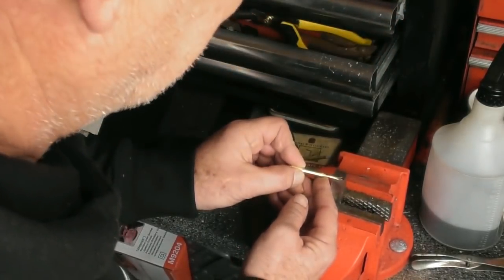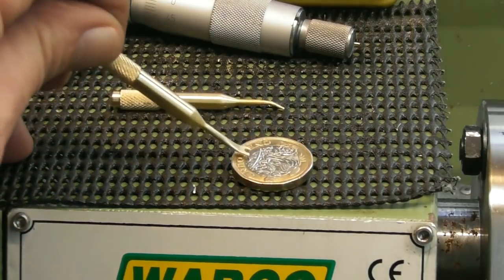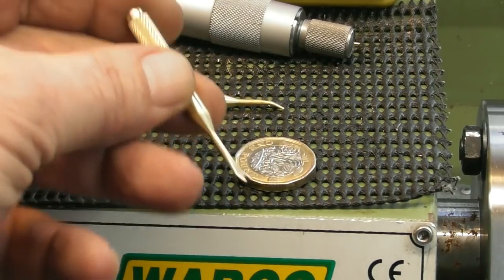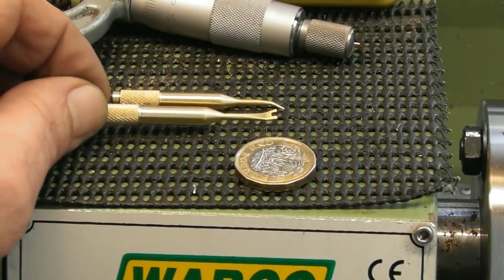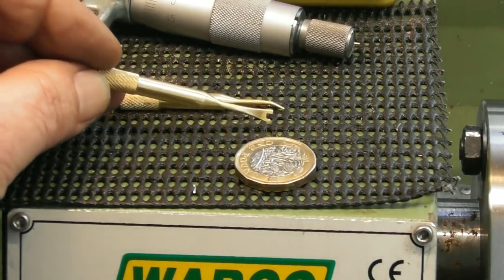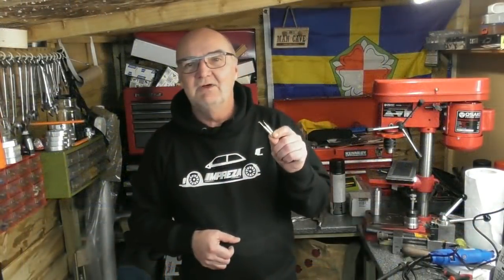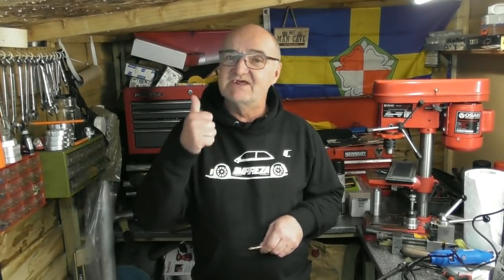Now I've just got to polish them up and that's job done. There we are — there's the finished articles. I did widen out the slot just slightly on the end. As you can see they are a prying lever; they haven't got to pry a great distance. I put a pound coin there just for a bit of scale. They're going to sit quite nicely in the hand when I'm prying the hands off. Delicate, gentle little parts — a bit fiddly on the end because that's sort of handwork to get the shape you want, but the rest of it was just turning. Happy with those — they're going to go into my watch repair toolkit. That's the two little crowbars finished. Thanks for watching guys, and thanks for subscribing. We'll see you all soon. Cheers now.